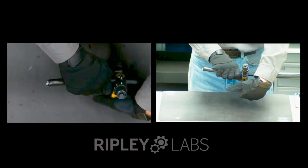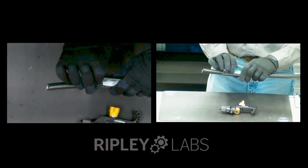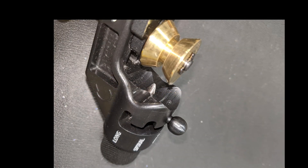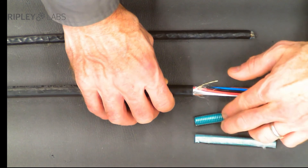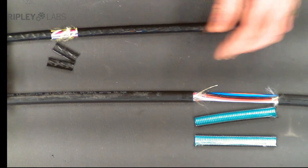For this demo I preset the blade depth, but that can be adjusted as needed when you're doing your very first cut. The final result is a clean precision mid-span cut into the armored cable. The precision tool's steel blade is held to a high quality standard and is adjustable in four thousandths inch increments to ensure repeatable and damage-free cuts in armored and heavy cable, but the Miller ACS Plus also has the precision for thin jacketed fiber optic cables.